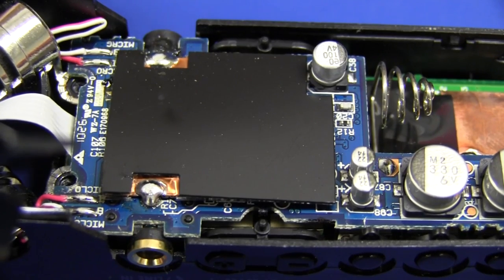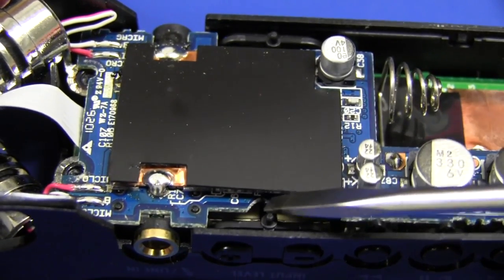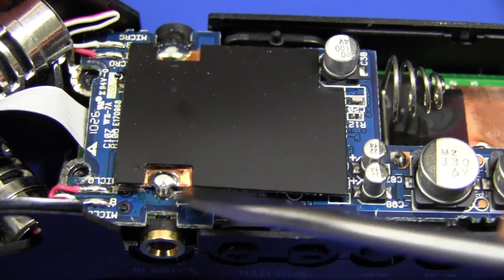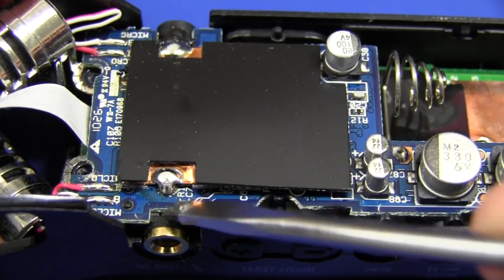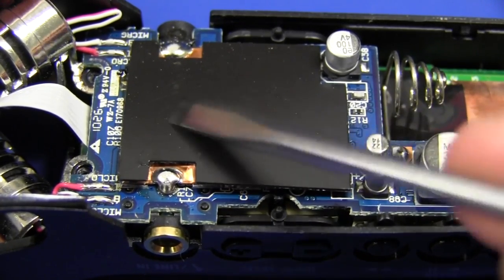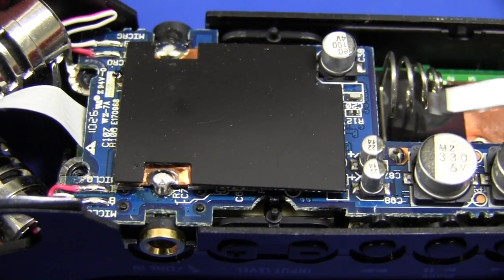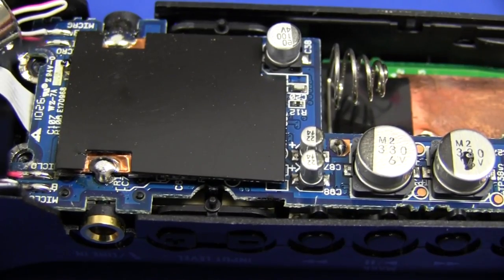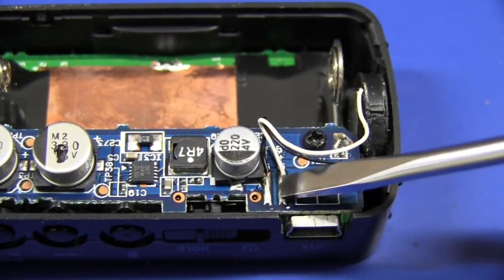Now let's take a look at this side of the top board - the blue board as we'll call it. There's a plastic covering, and there's another copper shield under all of that. That's not very surprising because these are your input and output connectors - this is all your audio stuff. Your analog-to-digital converter and your DAC and stuff will be all under there. The actual processor is probably down on the bottom green board, and I'd say this is all of your ADC and amplifier stuff. Because it's got to drive the speaker which is all the way over here.